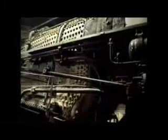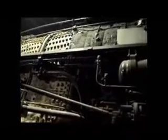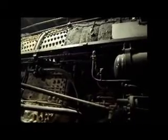And just a little bonus for you right here, this section here, you can't really tell because of the insulation, is actually an extension of the firebox without the fire in it, going into the barrel, known as the combustion chamber, and that just adds extra heating surface for the fire to heat the water.